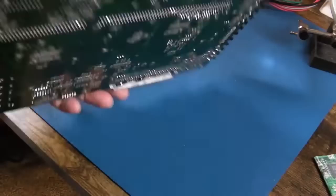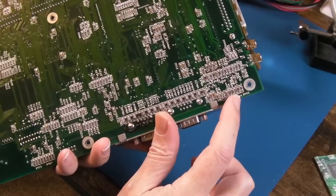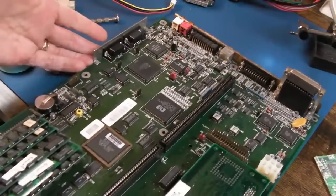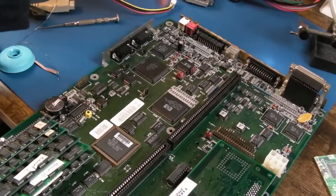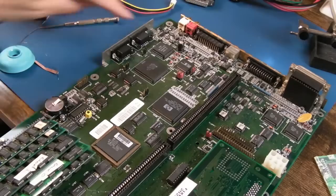And then the 100 microfarad, which I'm going to swap anyway, and I know that isn't going to be the issue. It's one of the ones up here somewhere. I've just took a screenshot, you know, a photo of that, and we'll swap that out anyway, just to rule it out. So there's nothing else on that. The transition from the fact the 12 volts coming into this area here to going to the op amp, it's going to be this.